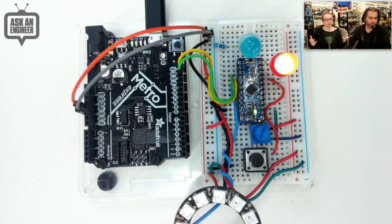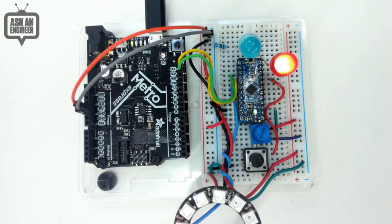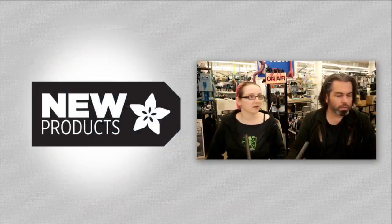So it's a NeoPixel output, analog input — a little all-in-one demo showing the hardware capabilities. You get basically eight or ten pins to do whatever you want, all over I2C. It's a really nice little Swiss Army knife: I2C to PWM, GPIO, EEPROM, analog digital inputs, and NeoPixel. And of course, if you want to write more Seesaw code, it's programmable. With a J-Link you can make your own custom build with whatever peripherals you want. So that was new products, Lady Ada — let's do our new product recap.